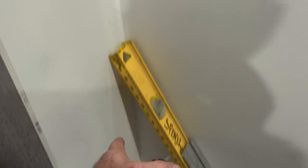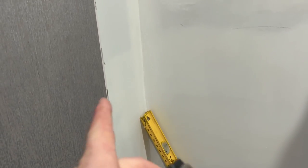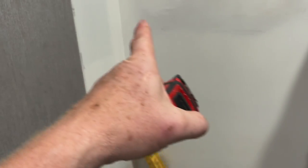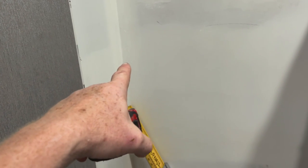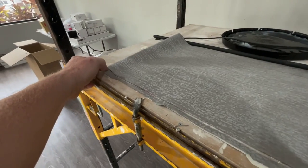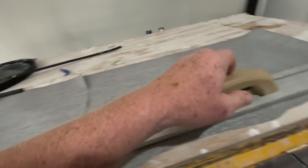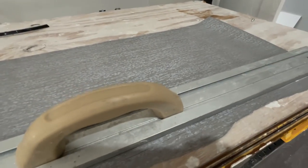The seam is challenged by a corner that is not 90 degrees. If you look closer, you can see curvature — it's not straight. So you want to yield to imperfections in the wall. You want to cut this first, overlap it into here so that your next sheet goes on top of that and you don't see that your wallpaper is overlapped onto another — just make it an eighth of an inch beyond that corner. To trim your piece of wallpaper, you could use a chop saw with a blade that's not going to tear up vinyl, or simply in your work area use this metal guide and take your blade and trim against it. This way, you don't have a factory edge but you have a nice straight edge nonetheless.